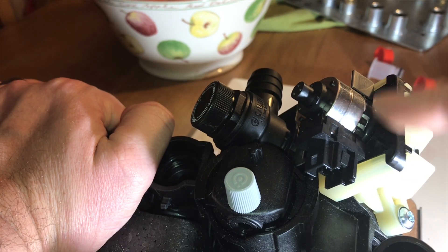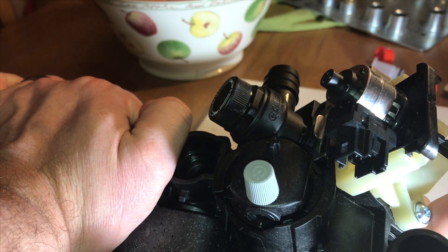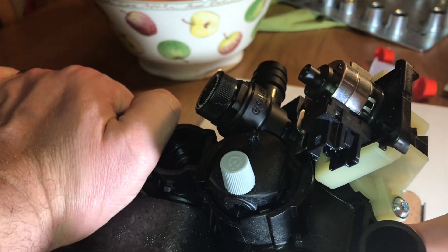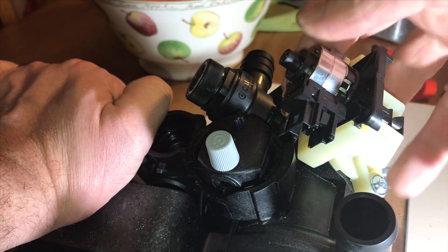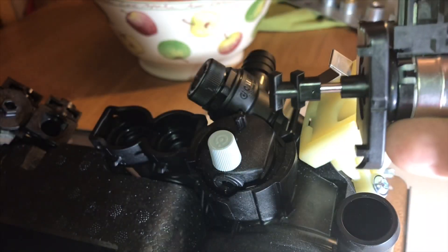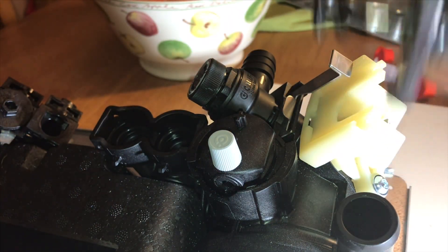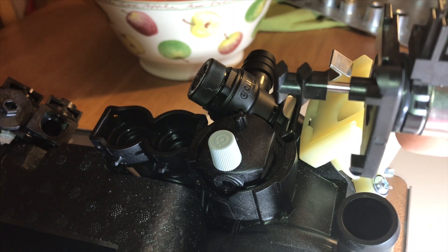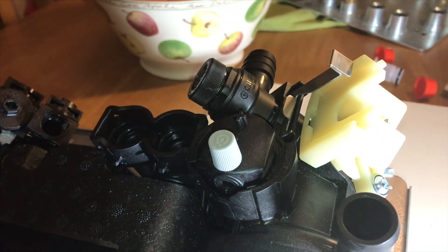Here we have the diverter valve. On the 200 range and the 050, the best method to take this out is to just pull it out. If you need the diverter valve body out, it's best to remove the pressure vessel cable, then pull it out, put some grease on, and put it back in. To check how it's working, a simple method is to put it in purge — it will move to the mid position. Whenever you're draining down a boiler, always put it in purge because the purge/venting sequence puts it in mid position. You can also turn the power supply on and off and you'll see it move to three positions as part of a safety check.